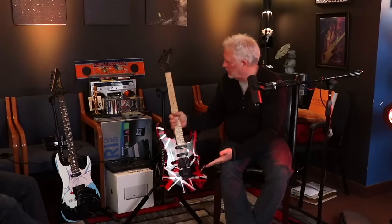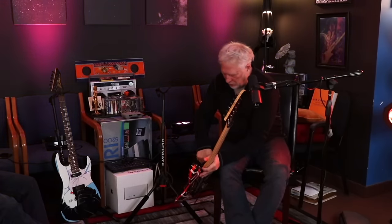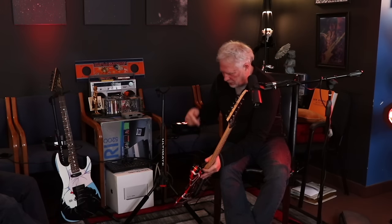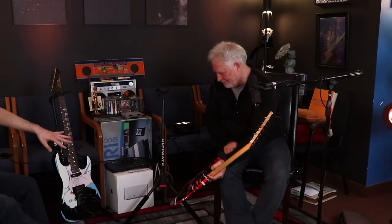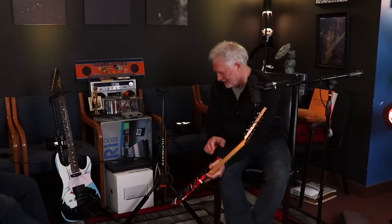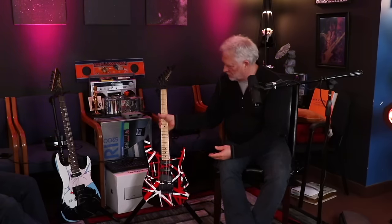This is on a very interesting material — it may actually even be ebony. You can see the thickness of the material in there. It was chipped before and damaged, so I went around the outside edge, sanded everything, and filled in every blank I could. The truss rod adjustment and the rear cover were repolished — got rid of all the scratches. I did a really sharp continuous radius rather than just a facet, and around the sides. I also inset this.